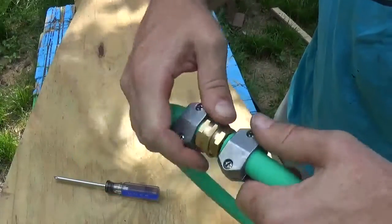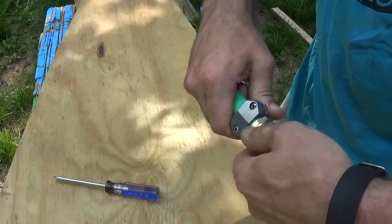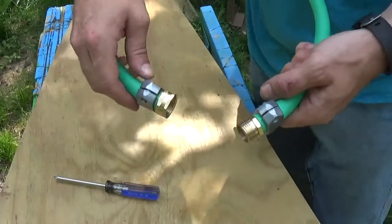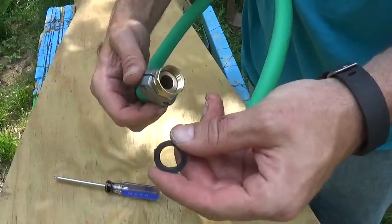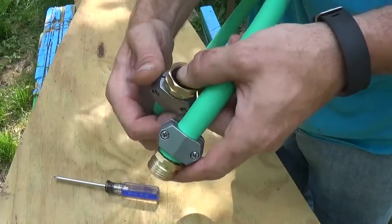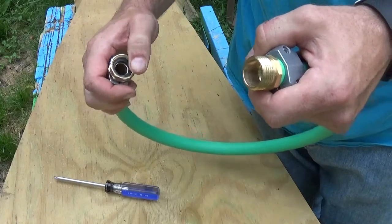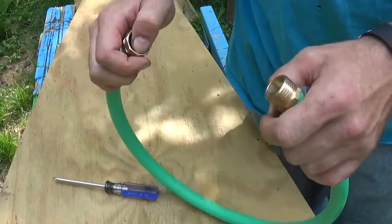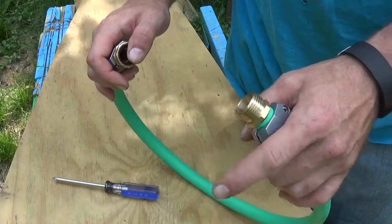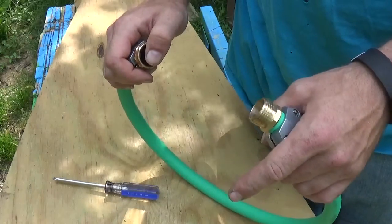And there you have it. Unscrew it — there's my homemade DIY hose, three-foot hose. This is the rubber washer — make sure you always get one of those, and have it popped in there, and you're good to go. Now this will run from my water pump to the cold line on my shower, and I'll have one that's much longer going from the hot water end on the pump to the shower as well, and then one from the sink cold line and sink hot line also.